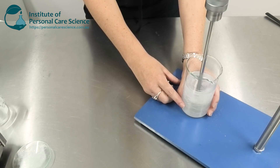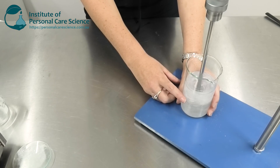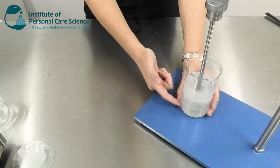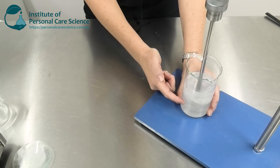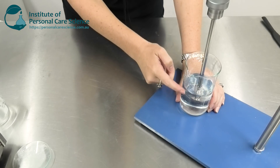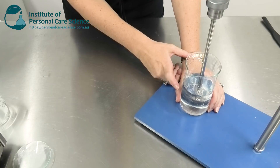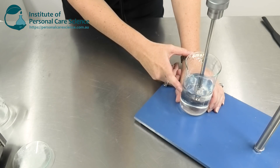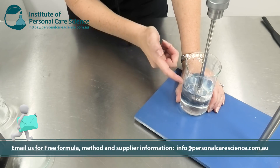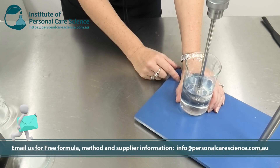We mix this in a large mixing vessel for a few hours. In the lab we don't have to mix it as long, but we just need to make sure we're dispersing and allowing the polymer to fully hydrate so that it forms our beautiful gel. Here we are after about an hour of mixing in the lab. A few hours in a large vessel and you'll find the polymer disperses really easily. There are still a few little clumps of polymer that just need to finish hydrating — about another half hour of mixing in the lab and we'll have our sanitizing gel finished.